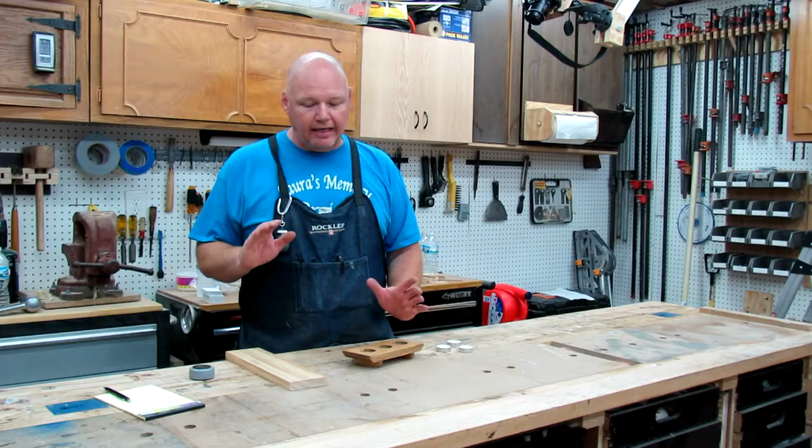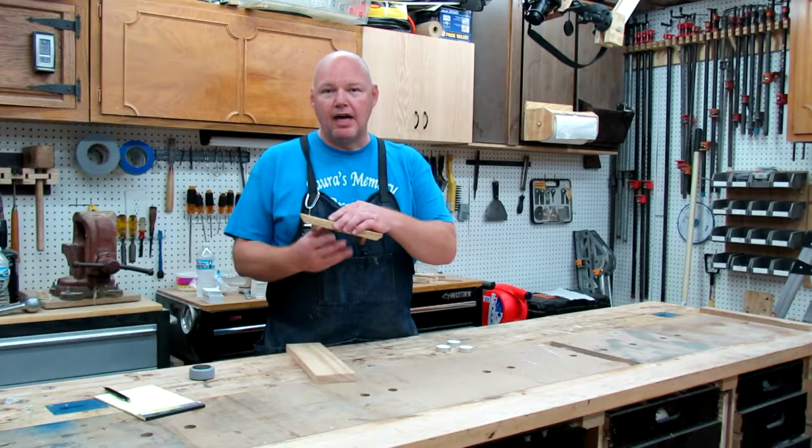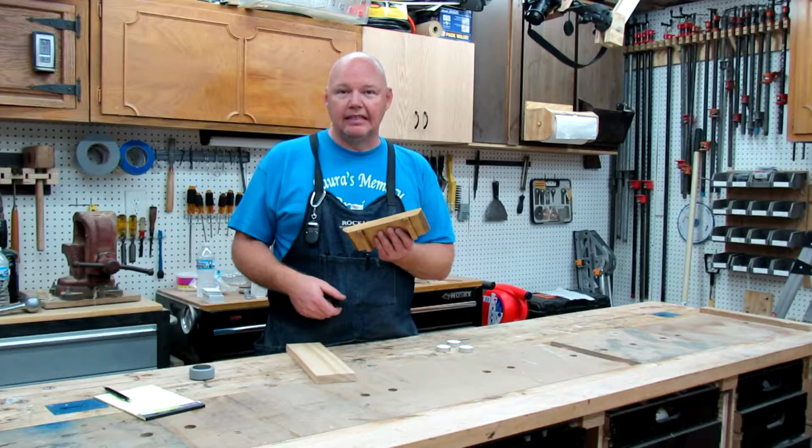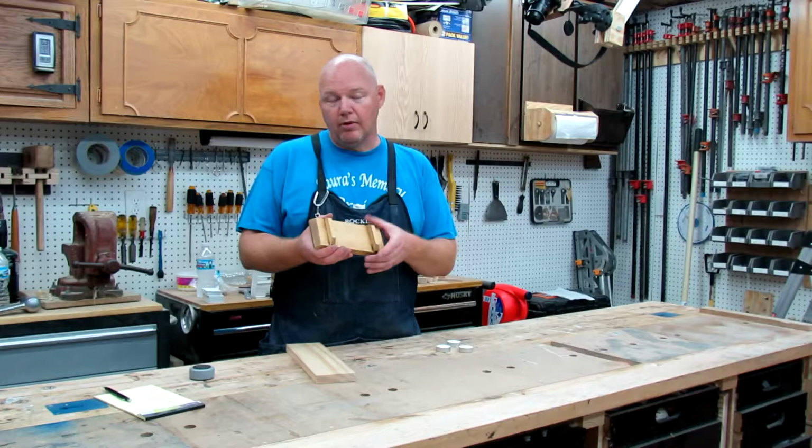And I've got this piece of 1x4, so I'm going to use it, and the secret is once you shape your top, you're going to make these cuts, then you're going to rip off the legs, and then you can cut them and put them on the bottom. That's why you need it 8 inches long, so that you've got the width you need, or the length really, I guess, for the legs to fit.